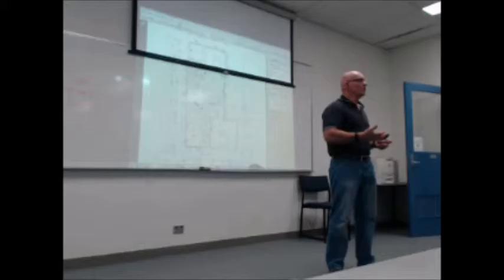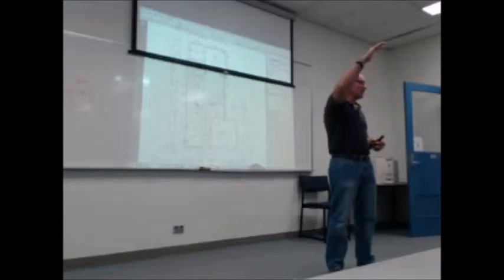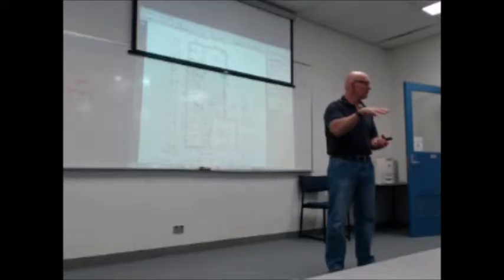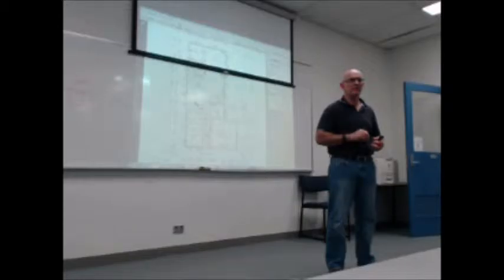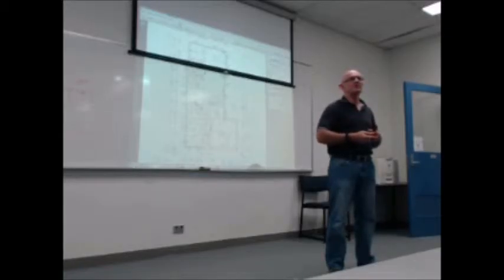Or, if you're working without specifications, you're working to the minimum requirements for the wet areas, which is 1800 in a shower, 300 over a bath, 150 over a vanity. All floors in all wet areas, all right? And you have to remember about waterproofing as well, okay? So you'll just work out an area, add 10%, and allow a provisional sum or a PC item.